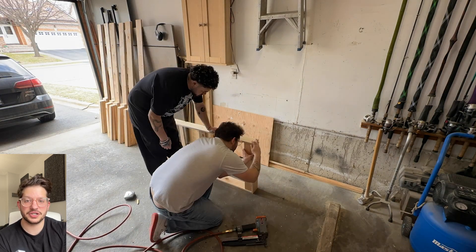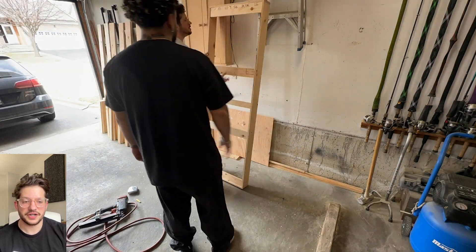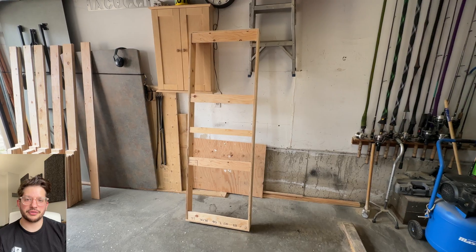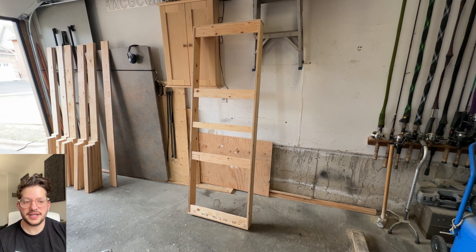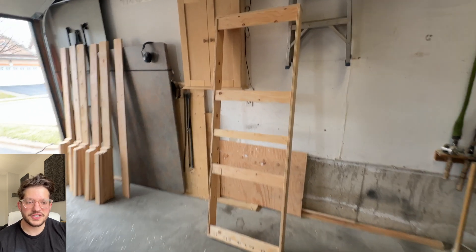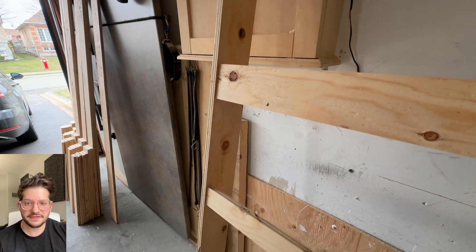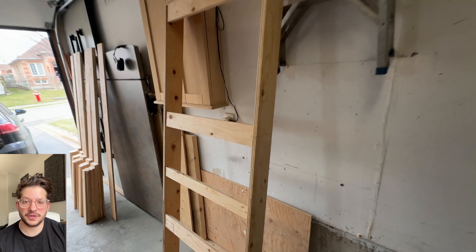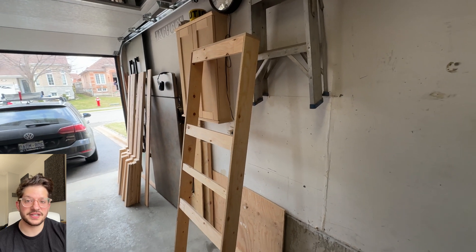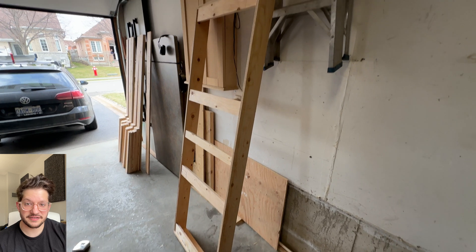I'm placing braces at two feet so that the insulation is only four feet long and has somewhere to rest, so no insulation bulges down into the fabric. There you can see the assembly of the frame — I'm doing three nails at each brace point. Here's a close-up: I left about a quarter of an inch from the front face of the frame for those braces so that the wood bracing doesn't touch the fabric, keeping that fabric face nice and flat and crisp.